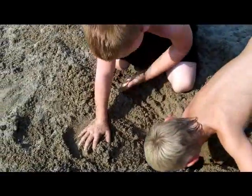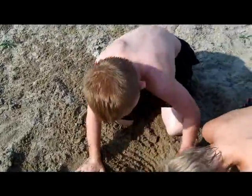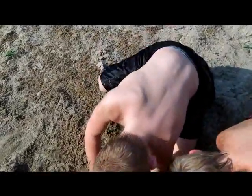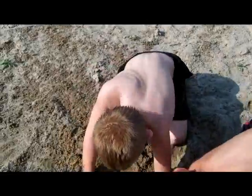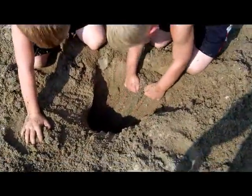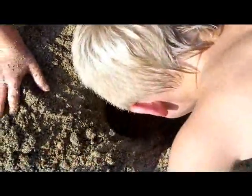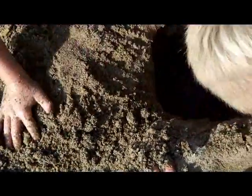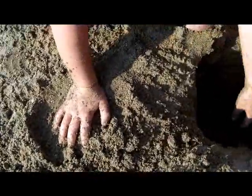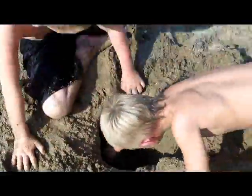Man, Bo is not getting tired — he's a trooper. Clean the sides out for him. You want to go a foot below the water level without knocking the sand back in. The sand just goes in automatically. He's knocking the sand right back in — that's alright. It will be a never-ending battle if you don't stay away from the edge of the hole, Alex. Stay away from the edge of the hole so you don't knock the sand back in.